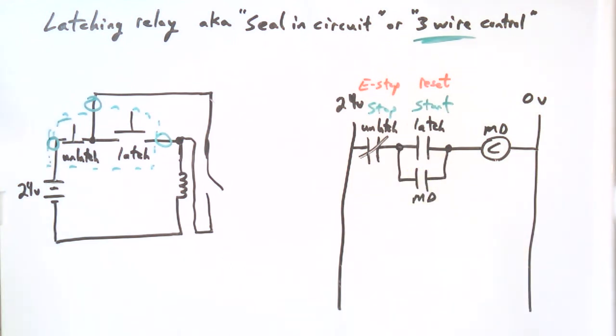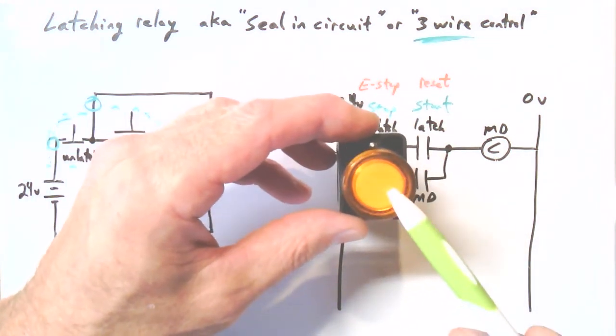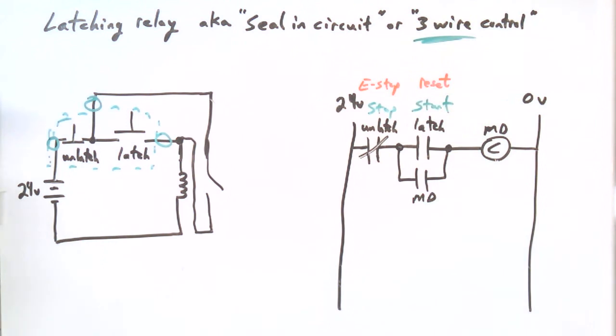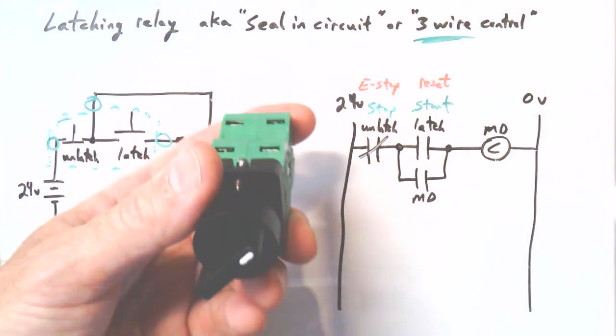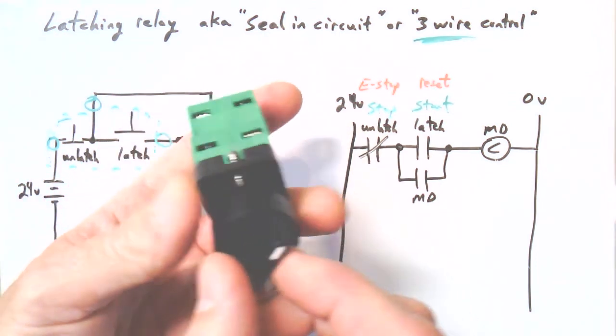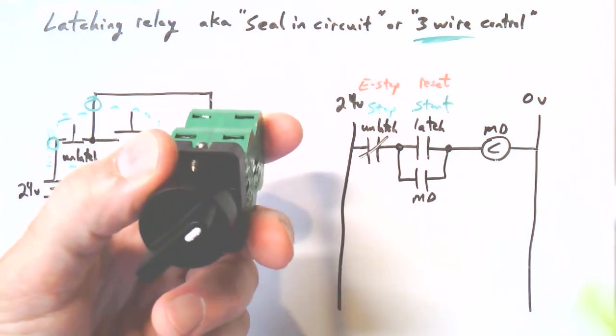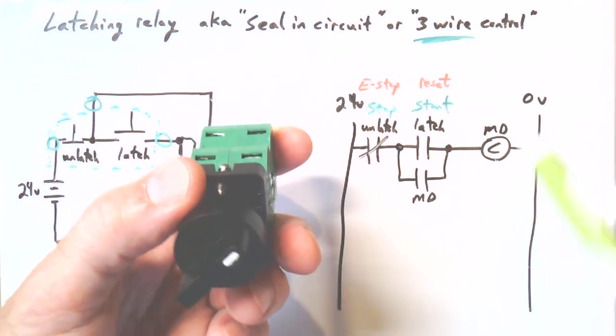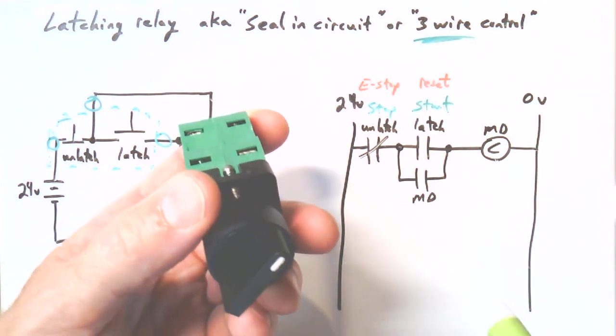What do you have to do? Well, you'll see an amber light telling you that you need to reset. Okay, when you hit the amber light, now power's restored to the machine. And so you get a lot of features from this latching relay seal-in circuit that are desirable. And yes, you might, if you're thinking about it, maybe the thought occurred to you that if we were still using this fixed position switch and it was left in forward, it's true the machine went down and it doesn't jump back to life when power is restored, but the operator, when he hits reset, it would jump back to life, which could still catch somebody by surprise.